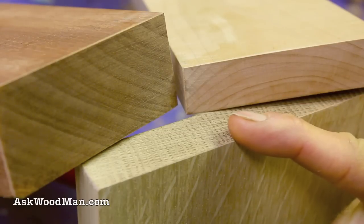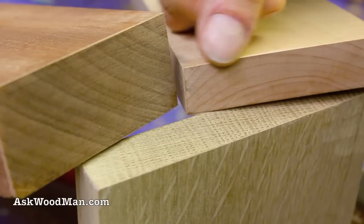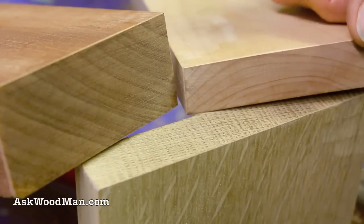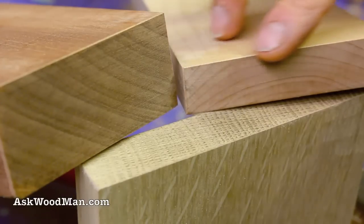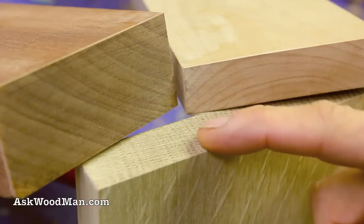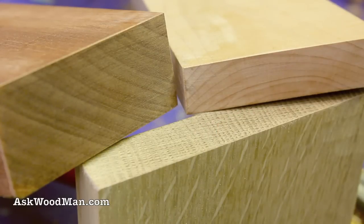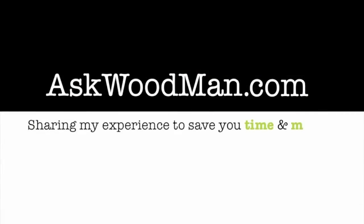A block plane on end grain is really a necessity — woodworkers need to learn how to sharpen and use a block plane for these instances. If you work with solid wood you're going to be dealing with end grain, and there's really nothing better for it. There's no heat generated at all. For dealing with small parts and unusual shapes, if you want to put a chamfer on pieces, do it with a block plane, or set it with a file and then come back and cut it clean with a block plane before you sand. It's just an invaluable tool to have, to know how to use, and to sharpen.